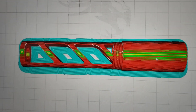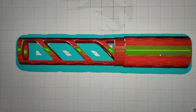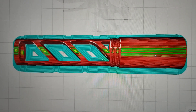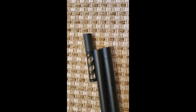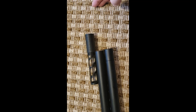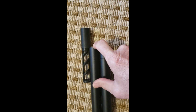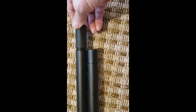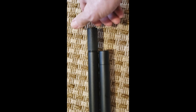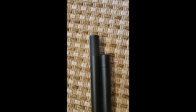I'm not an acoustical engineer. I didn't really have any way to design this with studies, models, or simulations. I just used other similar kinds of designs as inspiration and mocked this up. I used a sufficient baffle spacing that I thought would provide enough decompression for the gas, and I used a 6.5 millimeter center bore. Moderators that you buy for these rifles typically mount on the end of the barrel shroud and really waste the space inside — you get no benefit from it at all. By utilizing that space and extending the baffles into the muzzle extension, I feel you get a really good balance between length and the amount of moderation.